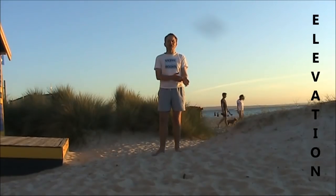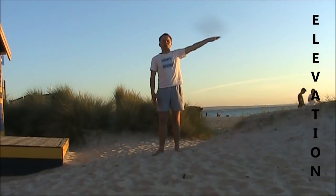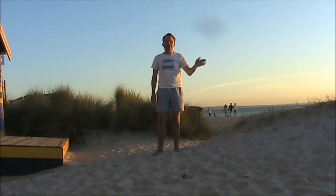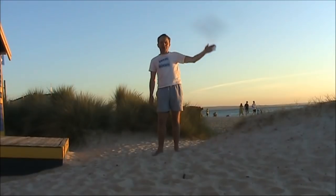Satellites are a moving target, and you need to know the difference between azimuth and elevation. Elevation is the angle above the horizon — zero degrees towards the horizon, 90 degrees straight up. A low elevation pass is close to the horizon, whereas a high elevation pass goes nearly overhead.